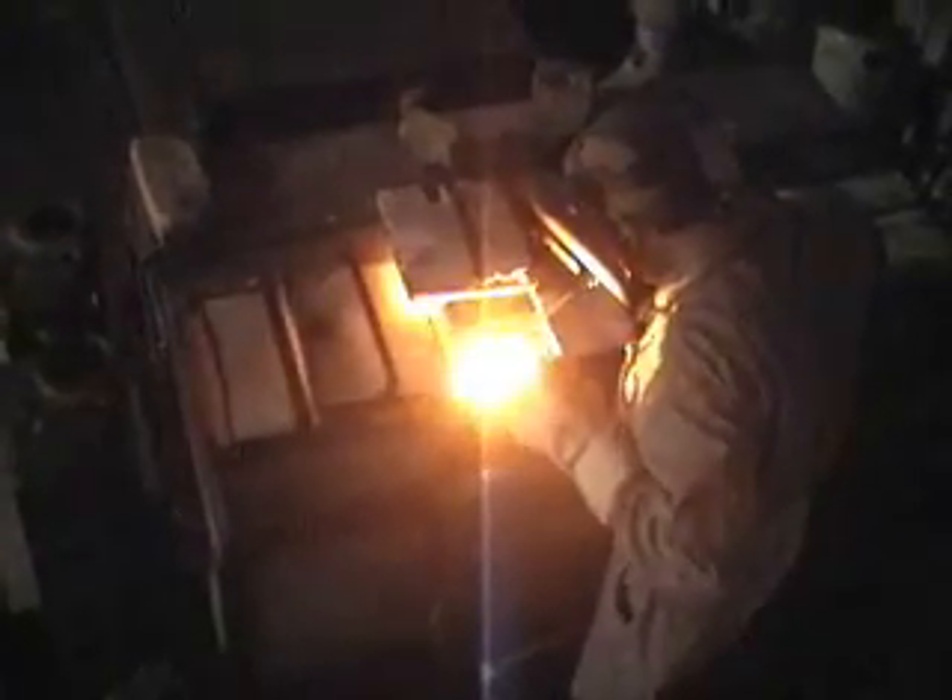The cracks are then cut out using an acetylene torch welding tip with the oxygen turned up to create a cutting flame. The crack looks just like a white line in the middle of the molten puddle of cast iron metal. The welder keeps removing the metal until the white line is gone or until they reach the water jacket.